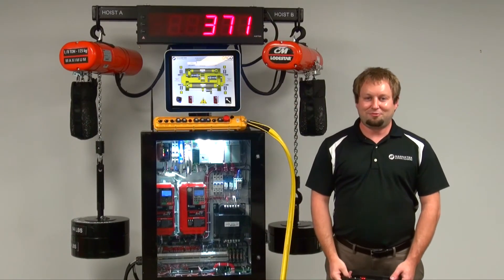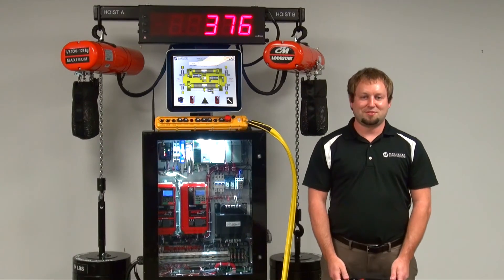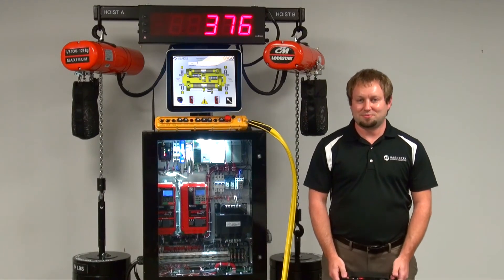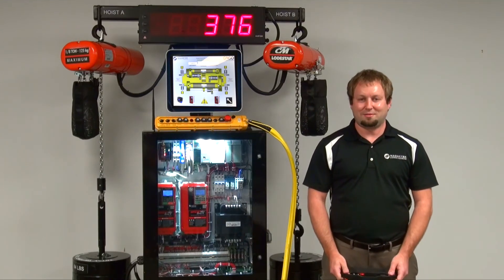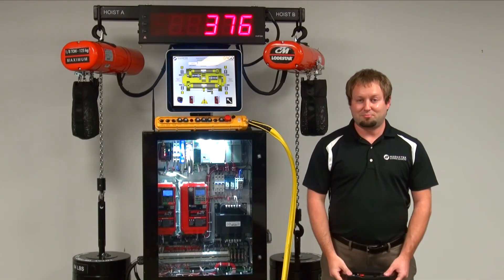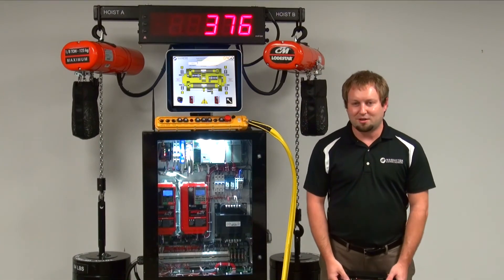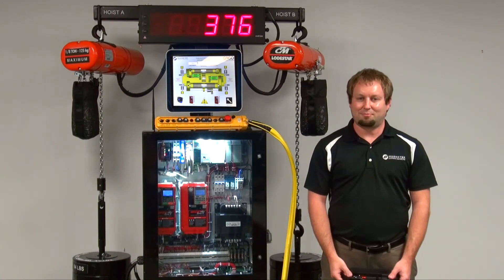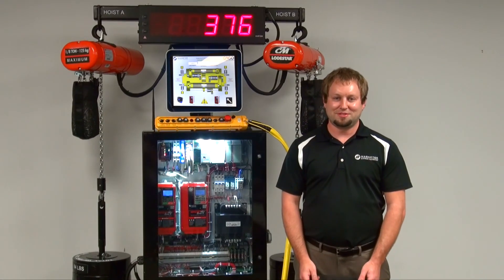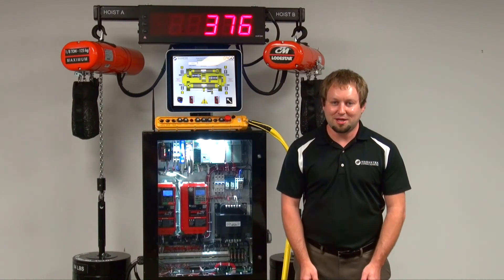The feature itself has plus-minus-five percent accuracy, and that's of the capacity of your crane. As you can see, our Weight Measurement System custom software is a great solution for improving the safety of your equipment and personnel. This new feature, plus more, are available within the drive itself, and it's all catered to the crane market. At the end of the day, it's all about safety — about your crane and its operators. You can learn more about these features at our website, www.magnetechmh.com.